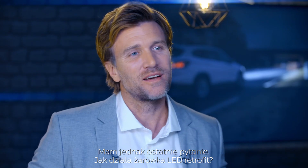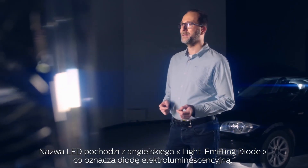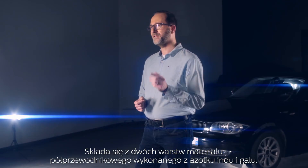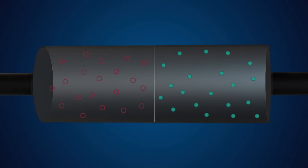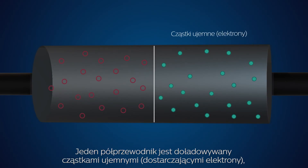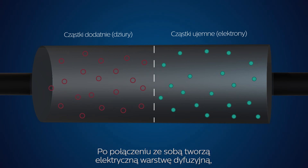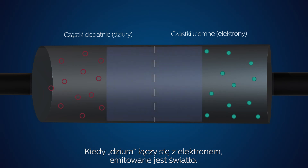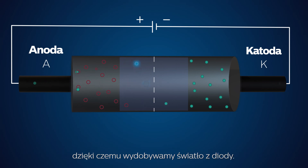I got one last question: how does an LED retrofit bulb work? It's not a very hot wire, as in halogen bulbs. LED stands for light emitting diode. It works thanks to an electrical reaction. The key word is diode. It consists of two layers of semiconductor material made of indium-gallium nitride. One semiconductor is doped with negative particles, providing electrons, and the other one with positive particles — holes — which absorb electrons. When connected to one another, they create an electrical diffusion layer where the positive holes absorb the negative electrons. When a hole merges with an electron, light is emitted. By attaching a battery to the LED, new electrons and holes are pushed into the diode, so we keep getting light out of the diode.